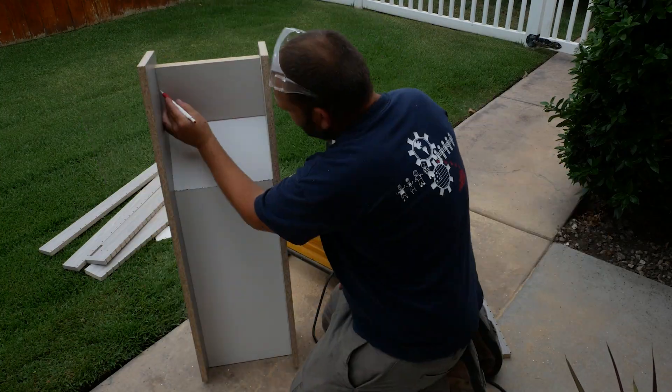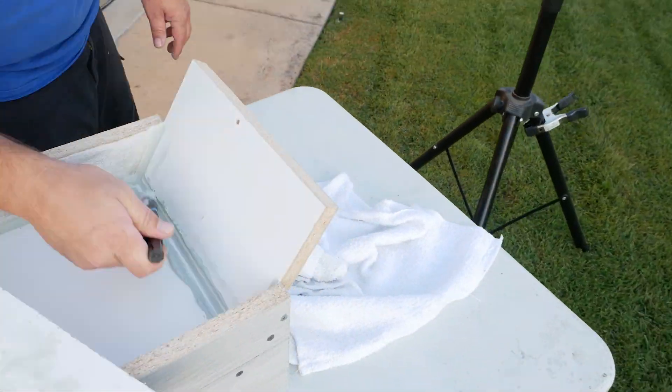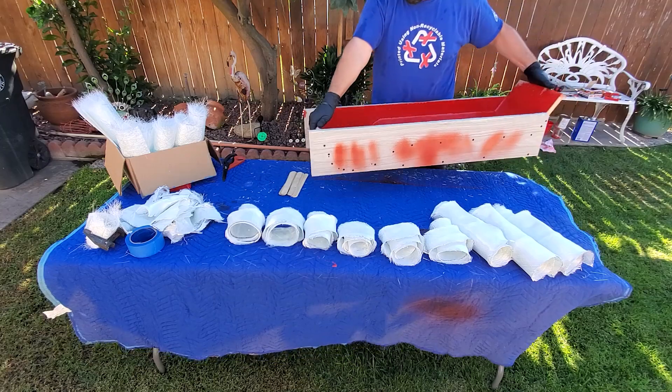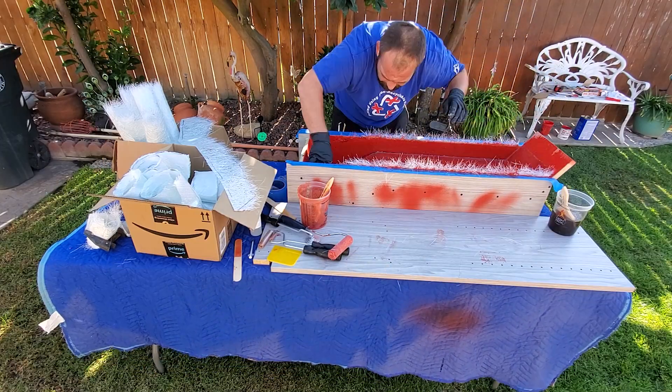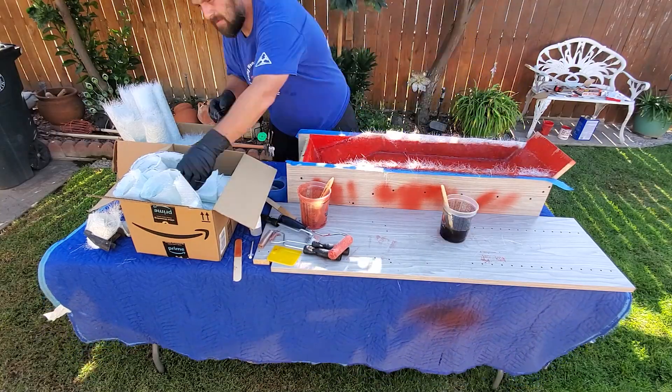Using those designs, the mold-making process begins. After the mold is deemed ready for production, a worker begins fiberglassing. Multiple layers are used, and the mold was previously sprayed with red gel coat to create a hard outside shell once removed.